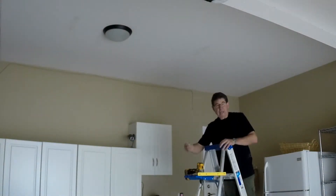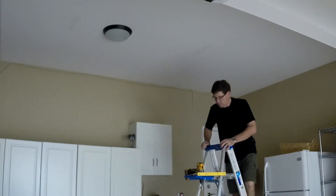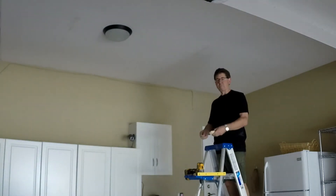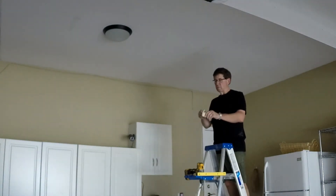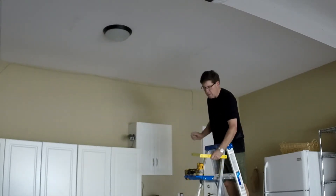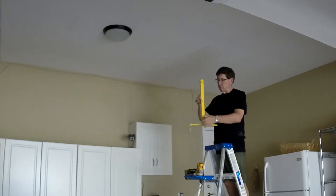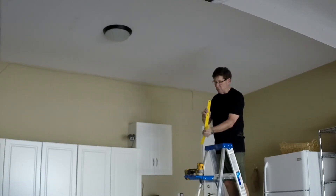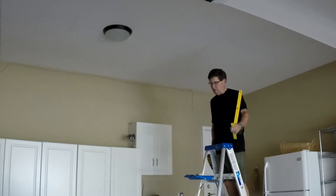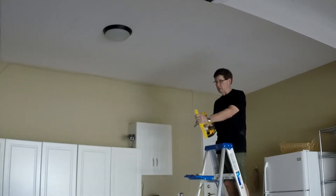Next, I'll use the lag screw to install the ceiling post to the ceiling. An old carpenter's trick that will make this easier for you is to take a bar of soap and rub the screw threads along it, soaping the screw threads — the lag screw will go in much easier. I now want to put the lag screw through my outermost hole in my ceiling post, and I can use a Phillips head screwdriver, crescent wrench, ratchet wrench, socket wrench set, or in this case I've got my socket on the end of my drill — a lot easier that way. This should be a 3/8-inch socket.